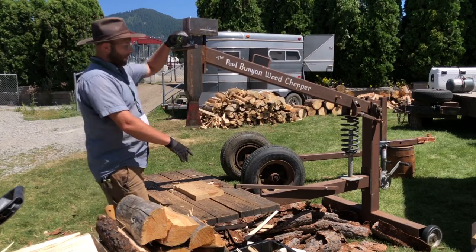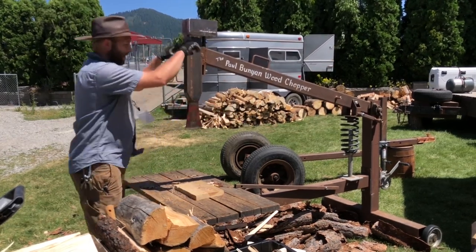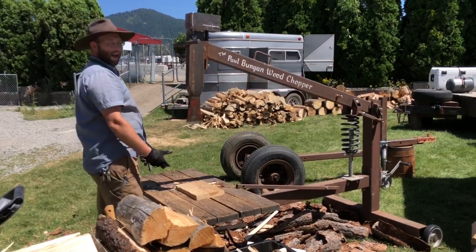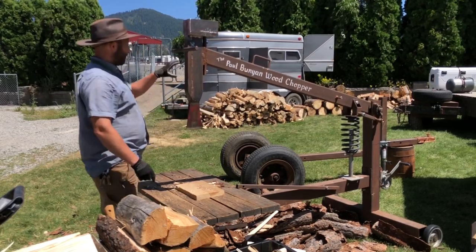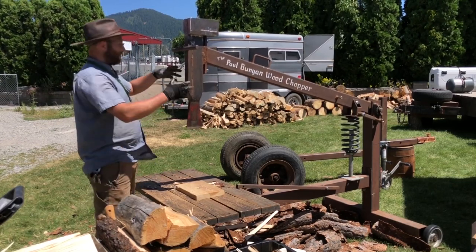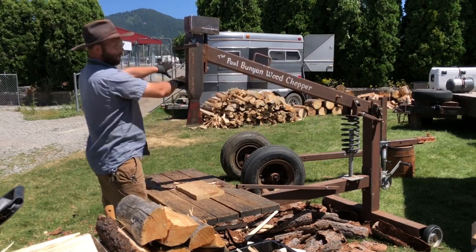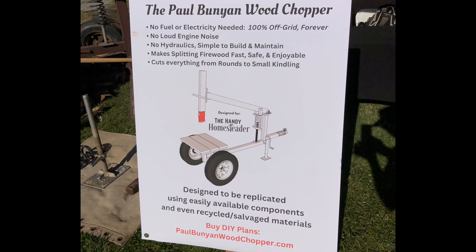When I first built it, I realized I built it backwards with the wheels over there — that's the light end. So when I go to move it I have to lift the heavy end, meaning the wheels aren't working for me very much. So last week I welded together a 2.0 version of the frame. This is ready to just cut the top half off and move it over and weld it onto that frame, so the wheels will be under the heavy end and I'll be able to lift the tongue by hand and move it around.